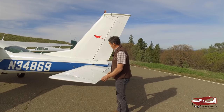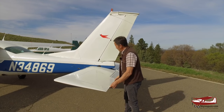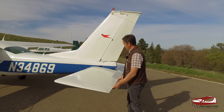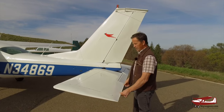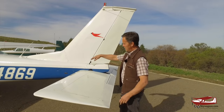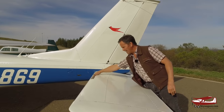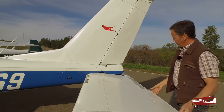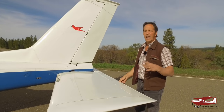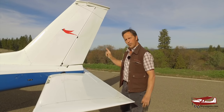The Cardinal tail is one of the few Cessnas — maybe the only one — where the whole horizontal surface flies as a stabilator. On the early fixed-gear 150-horsepower models in the '60s, there was a tail-stalling problem, so they added slats. This 1976 model already has the slat in the leading edge. The whole tail moves — but what if even the vertical fin moved? Let's look at the Mooney.